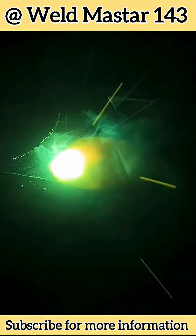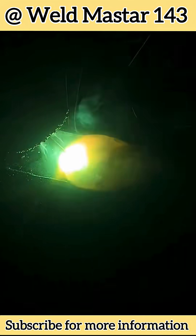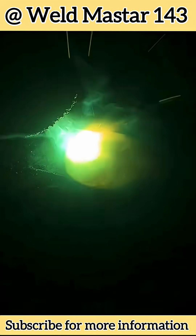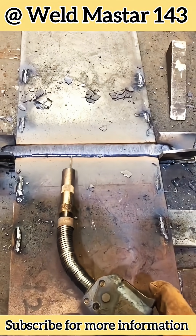While it may look smooth on the outside, in reality there are many tiny gaps and seams on the surface. With all these gaps, it's much easier for the wire to absorb water from the environment. That's the first reason flux-cored wire often causes porosity.